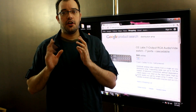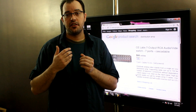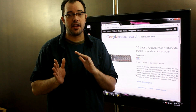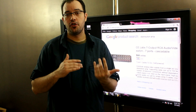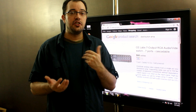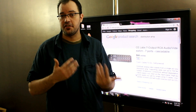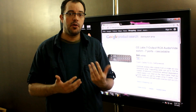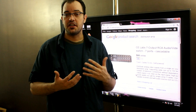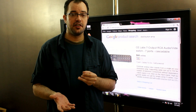If you are just splitting something twice, the auto gain control on the line in on your device is probably going to handle it okay. You'll just end up with a little more noise because you're using the auto gain control to run the signal up. You still get some added noise and distortion with a distribution amplifier doing the same thing, but because it's a dedicated device designed for this, it's probably going to be better than the auto gain control built into your device.